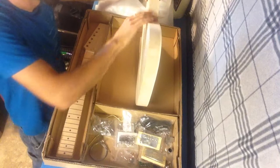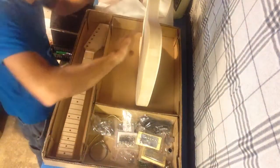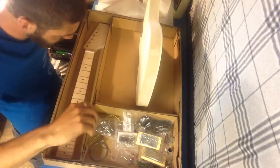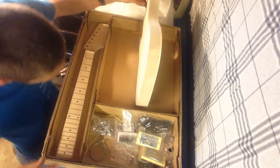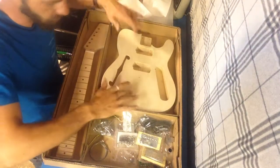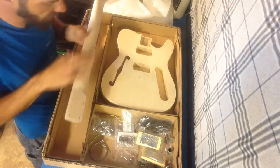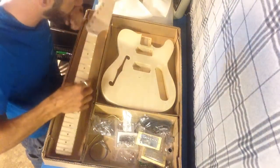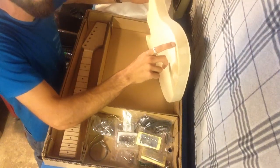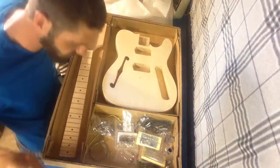I'll do a 400. I'm going to do a dye and then do a rubbed finish on it, true oil, Danish oil, French polish, whatever you want to call it. I know they're all different, but they're all pretty much the same method is what we're going to do. But we're going to dye it first. We're going to leave the maple of the neck on there, and we're going to dye this the same color as the top and the back. And I do believe around this band here, and I'll let it creep over the bevel, I'm going to paint it a solid color. I'm thinking like a blue-green, turquoisey type thing.